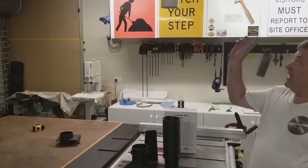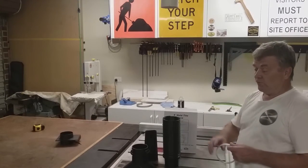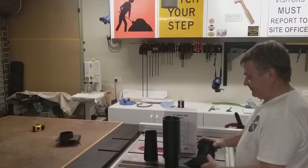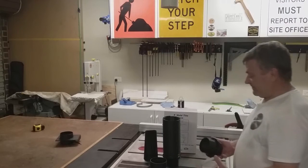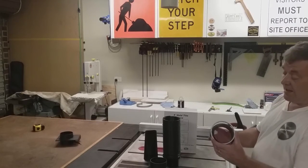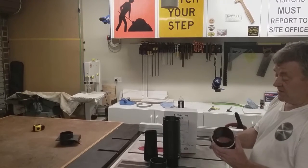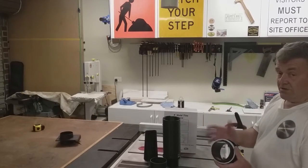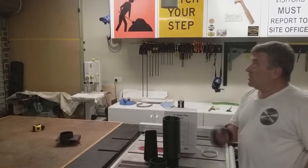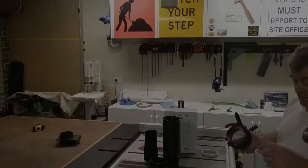If I hadn't found the communication conduit large radius elbows and was still using the 100mm drain water and sewer fittings and pipe, there would still be a fair bit of play around the 100mm pipe to this fitting - you'd need a bit of tape or foam seal to push it up in there. I'll be coming off that elbow with a piece of communication conduit - you'll see.